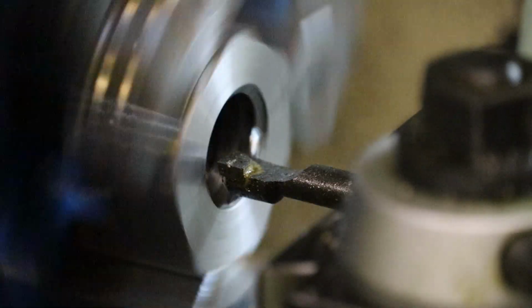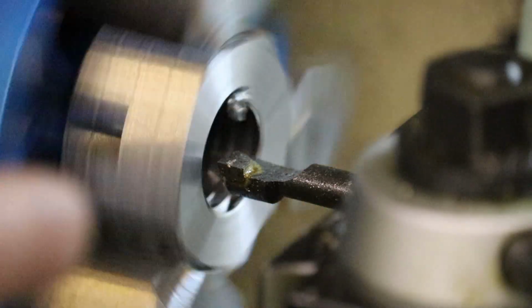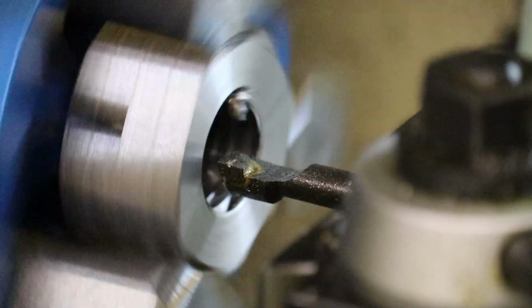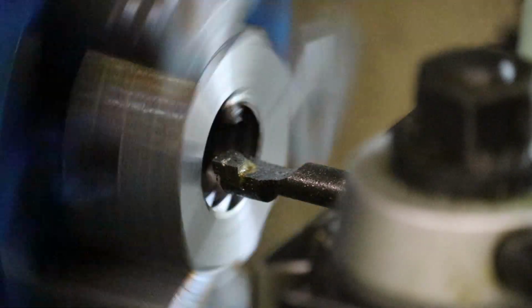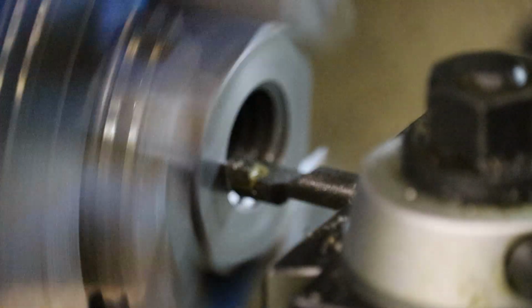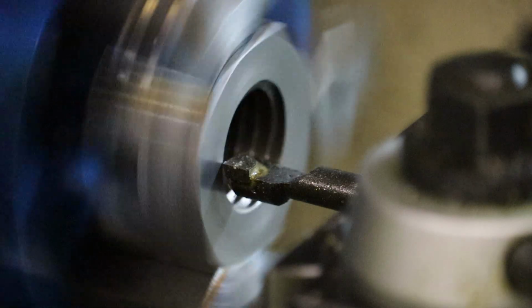Okay, so I've got the spindle set at a constant 500 RPM, and I've loaded this boring bar into the tool holder. It's sticking out a little farther so the camera can see it. We're going to put our final chamfer into the backside of this nut for a lead-in. And on the controller, I'm hitting do one, taper, minus 45 incremental set. So now we're set up in the taper mode again, or 45 degree cut mode.